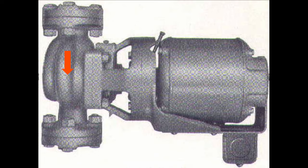And Gil writes this paper where he explains that these high head pumps that are producing a lot of pressure, mounted on the return side of the system, pumping toward the boiler, are causing a drop in pressure that's sucking air into the system, and that is the air that is eating the boilers, and that air is then getting spit out of the system by air separators on the supply side. So the whole engineering community worldwide pretty much goes, aha, and they realize that he's right, and they move the circulators to the supply side, pumping away from the compression tanks, not so much from the boiler, but the compression tanks, and I'll tell you a lot more about this as we go along.